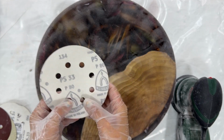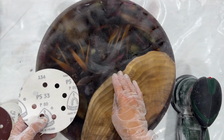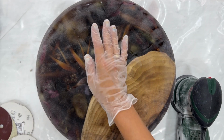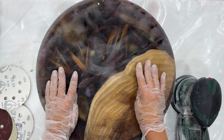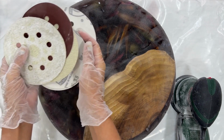The 100th should only remove and smooth out what the 80th did. It can't remove what a larger grain that fell underneath you did. You have to understand this. On your table, when you are working at sanding before coating with a finish or covering with a parallel edge, you must hold the discs in steps, those that you will use.